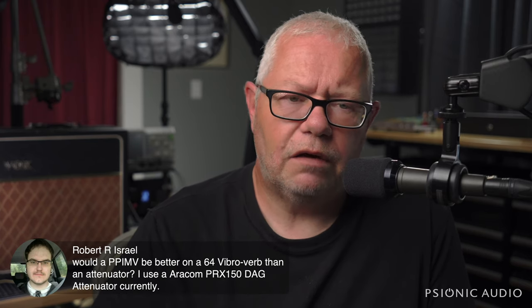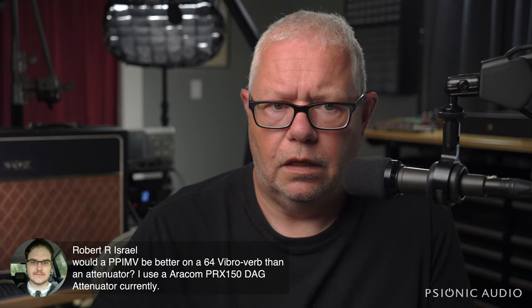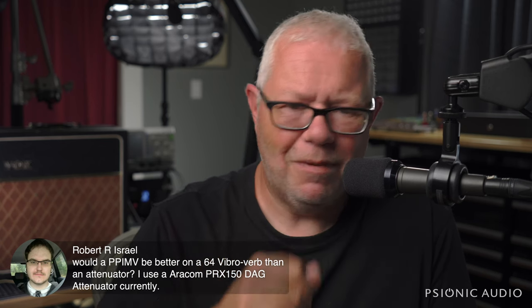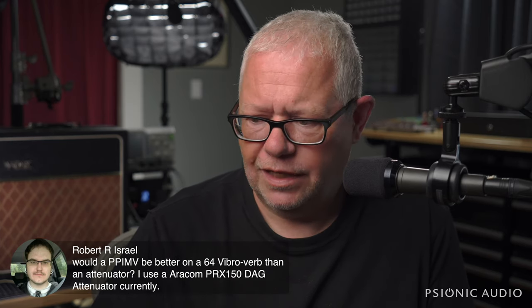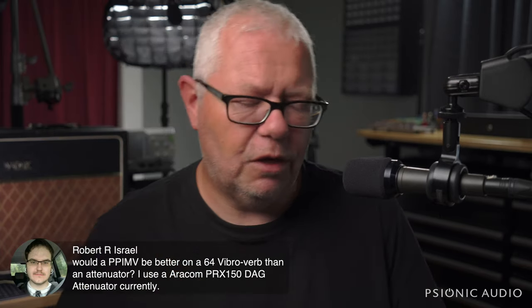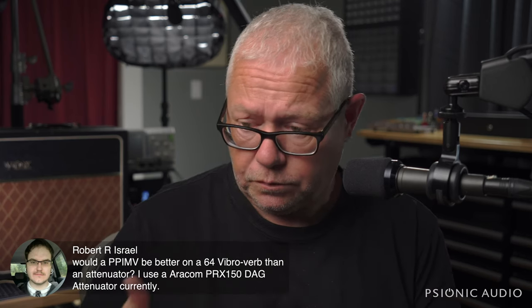You might like the sound of the attenuator better. I would say that as far as reliability, the master volume is a better option. And you might not hear much of a difference. Either way, you're not going to be driving the speaker as much. And that's where you will hear a difference. Anything which lowers the output level of the amplifier will move less air into the speaker.